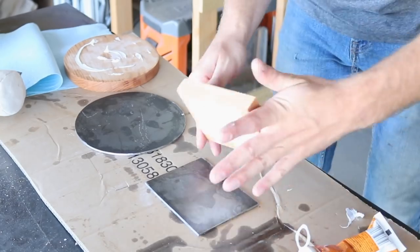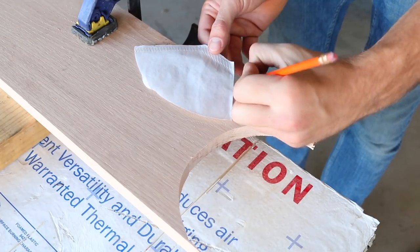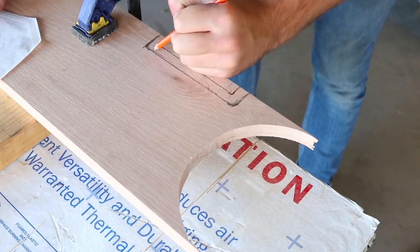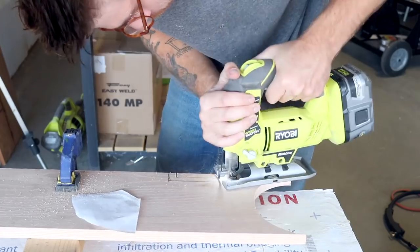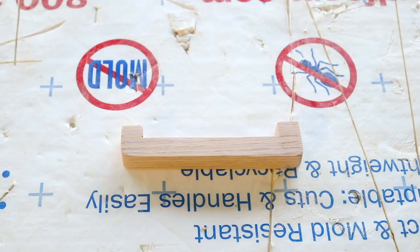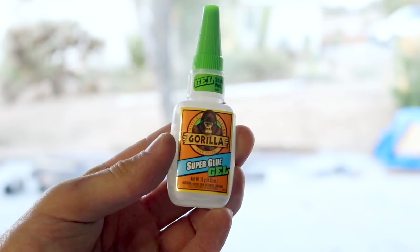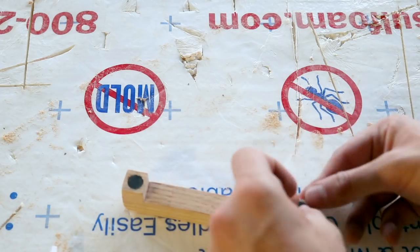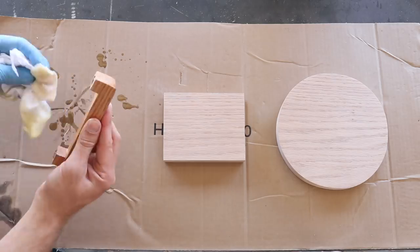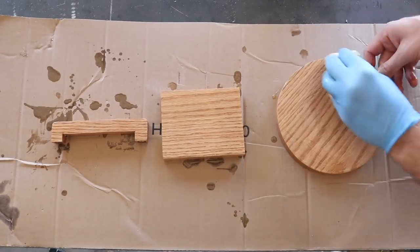I used construction adhesive to attach these pieces of wood to their metal bases. The last accessory I'm making is a holder for the coffee filters. After figuring out its inside dimension, I drew the shape of the holder and cut it out with the jigsaw. What's really cool about this accessory is it attaches to the side of the coffee station using magnets. I used a Forstner bit to drill out a recess that was the same size as the magnet, and then I used Gorilla Glue Super Glue Gel to attach them permanently. They were in there so good that whenever I went to replace the ceramic magnets with neodymium ones, I had to drill them out instead of pull them out. The final step was to apply a couple coats of Maker Brand Simple Finish to all the accessories.